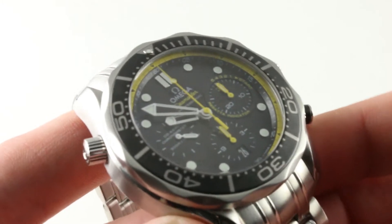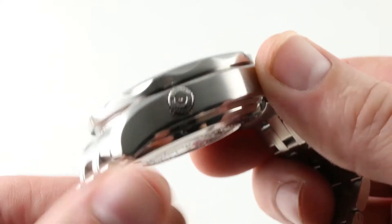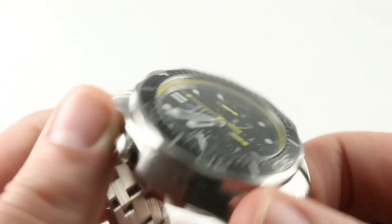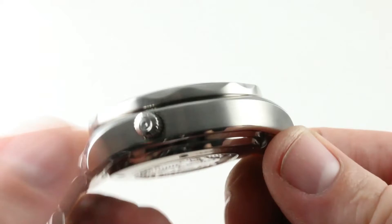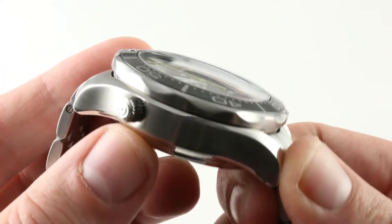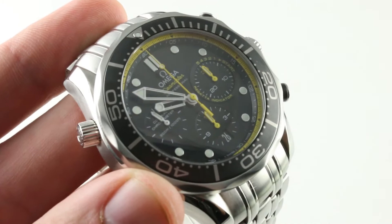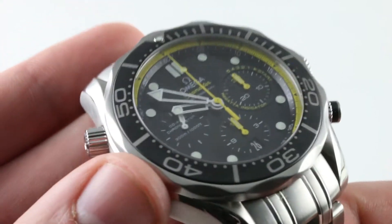The timepiece features a number of familiar elements, including the beveled case, polish on the bevel, satin finish on the flanks, and a helium escape valve — not just for saturation divers, but it also features a coaxial pusher inside the valve. Because this Caliber 3330 is a converted Valjoux 7753 that's gone column wheel and coaxial, you lose the quick-set function when you make the 90-degree rotation of the chronograph caliber. So this is a double-function helium escape valve. You'll probably get more use out of it on this model than all other models combined — it has a functional role in your daily use of the watch.